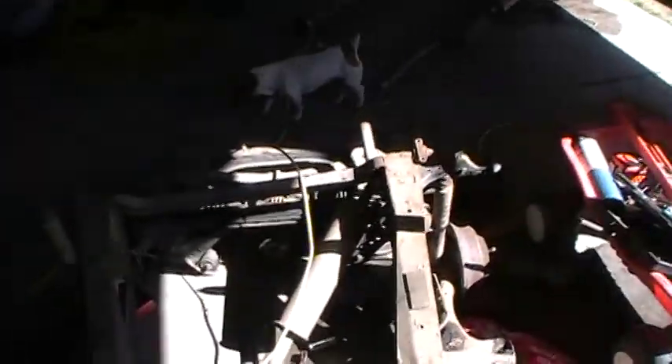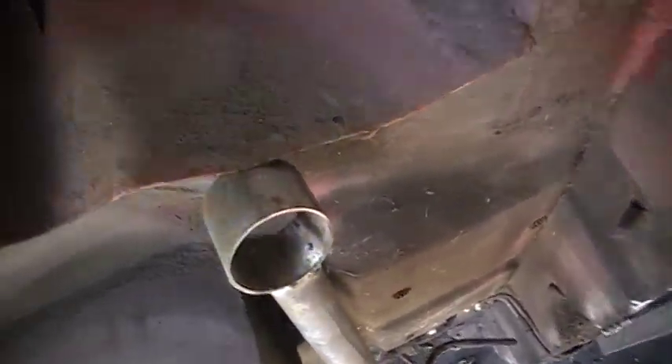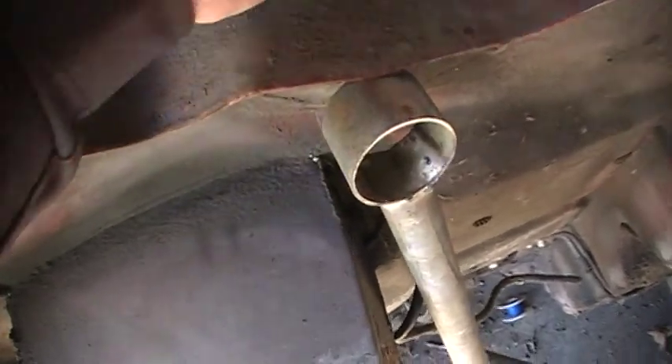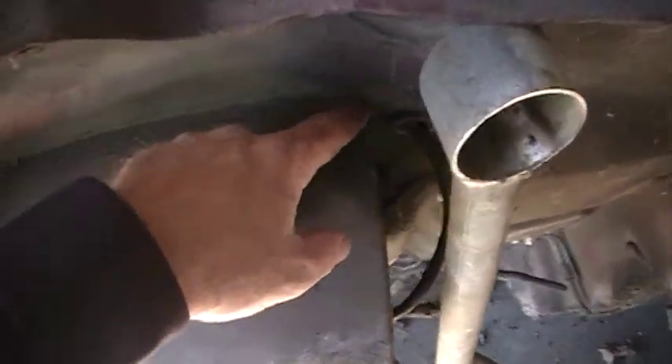I might even use these mounts right here to tie the frame into the subframe. I already showed the rear subframe previously. I'm probably going to have to cut either completely back here out, or definitely cut a section of this here out, because it's gonna have to countersink — it's got to sit up somewhere like this so the floor or the boot is actually gonna be a little higher up here. I'll cut the battery box out, set it in place, maybe sit the car on top of it to get a feel for where everything sits.